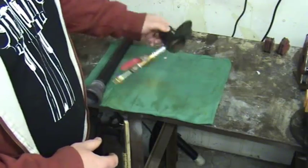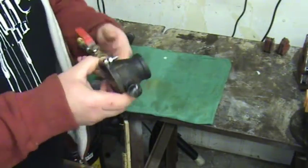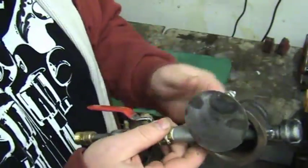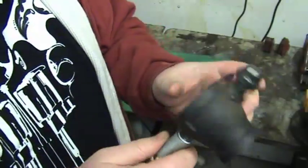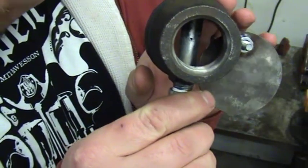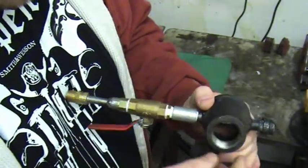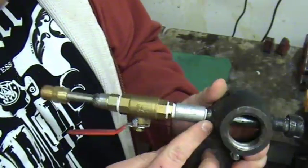On the other end, this is going to be our propane delivery system. Essentially what I did was drill a hole in it behind the band and just put a half-inch piece of steel tube in there and welded it in. This is the nozzle — this is where the propane is going to be coming out of. You can see the hole in there; that's a 40-thousandths hole. I used a number 60 drill bit.